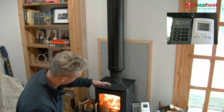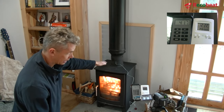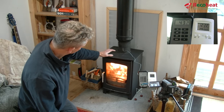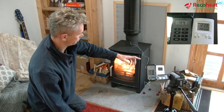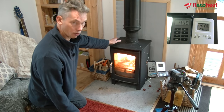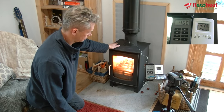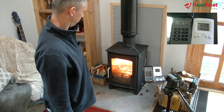This is actually the hottest part of the flue. Even though it's a perfectly normal stove with baffles — brick baffles at the top — the heat is at its most intense here as it exhausts out of the flue. It's now whistling because of the thermometer wire in the tube, as it's hit 440 degrees, nearly quadrupling the volume of the air being pumped through. It's going to start levelling off at around 460 degrees — that's probably the heat of the fire.